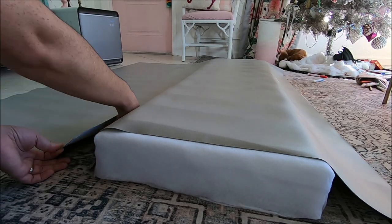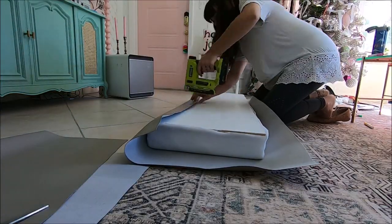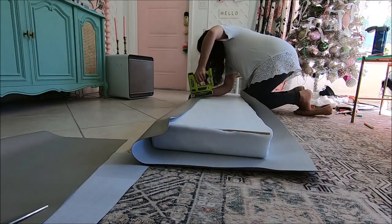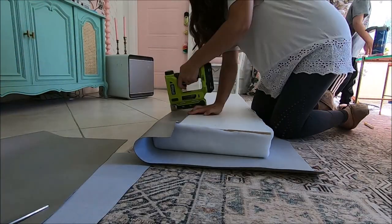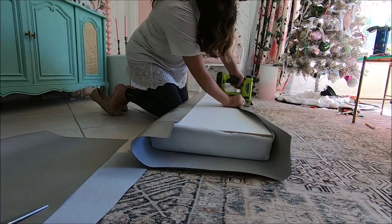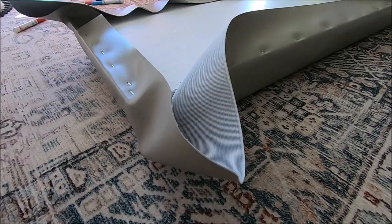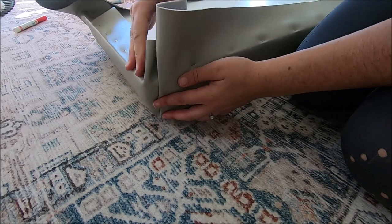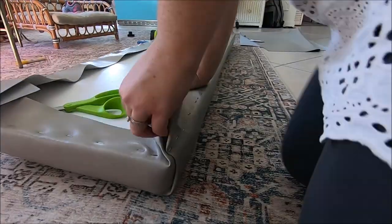I'm using gray vinyl and I cut it about three or four inches too big, which is exactly how you want it. Then I started using staples to attach the vinyl to the base. Go along one side and make a nice long line of staples, then the next side is really important — you want to tug that as tight as possible. You cannot make this too tight. I kept checking to make sure it was nice and tight because if it's too loose you'll have problems. For the corners I just folded it in, made it as smooth as possible, and stapled it down.